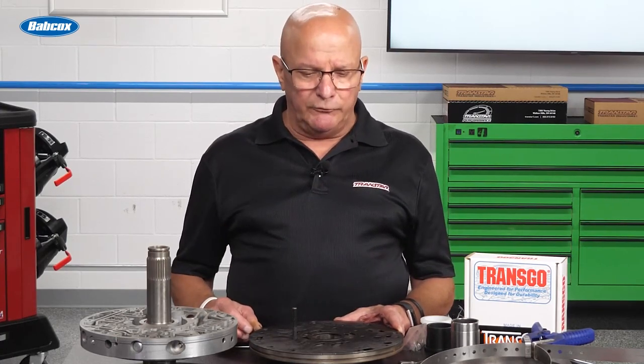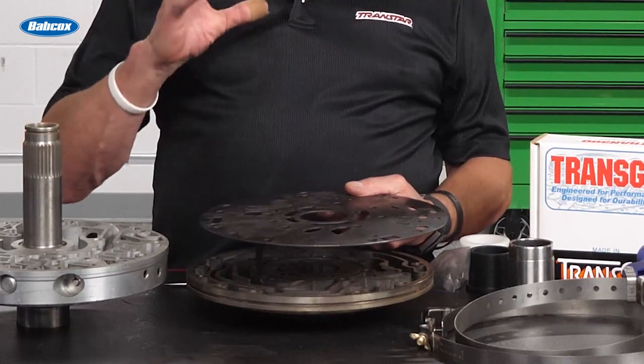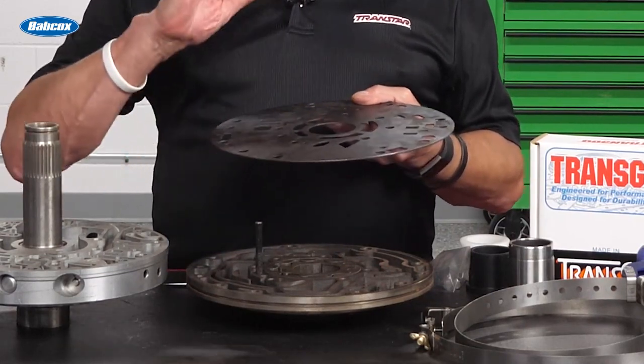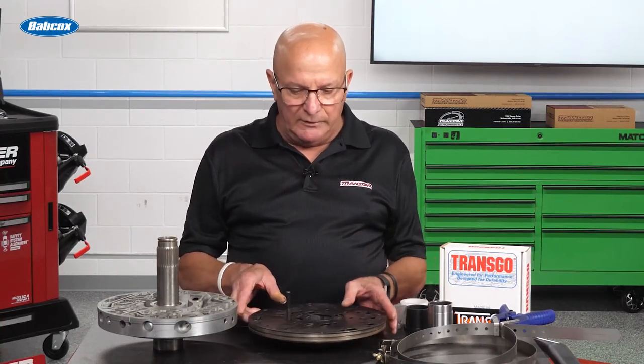Probably the biggest reason is a ground issue. You can tell it's a ground issue because when you separate it, you broke the nice connection it had. There'll be tracer electrical tracks — there's been a lot of seminars on it and it's been talked about everywhere. So when you go to do these, please clean the factory grounds even if they look good. Remove them. It usually goes from the engine to the frame. It's never a bad idea — in fact, it's never a bad idea on any unit to absolutely check the grounds.